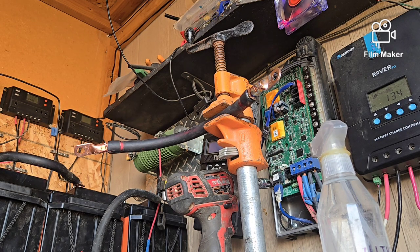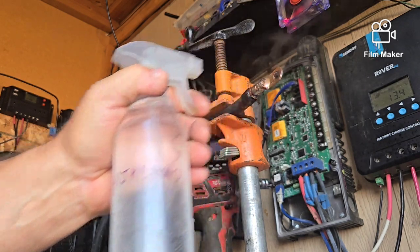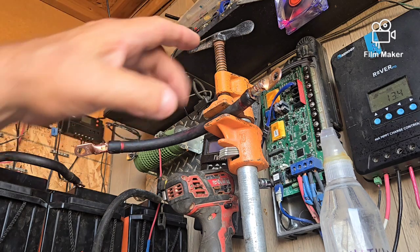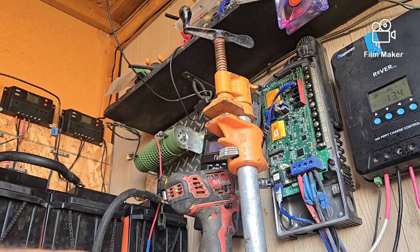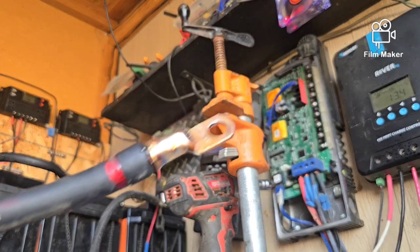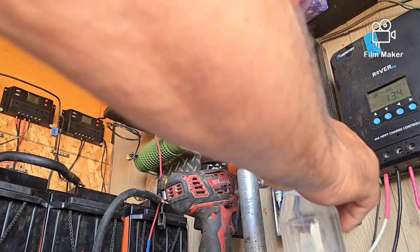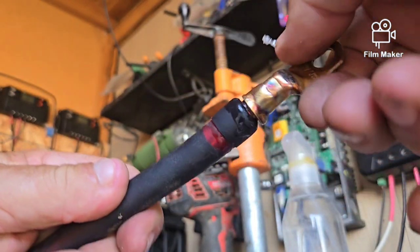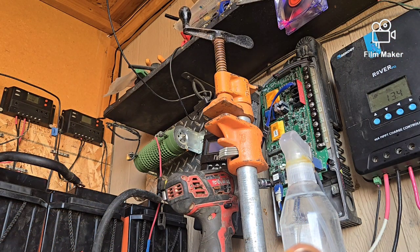I'm going to shut this off so I don't burn extra fuel, drag out my next six-inch length of solder, and have it ready for the next one. In the meantime I'm going to give this a little spritz. That's all it takes — now it won't fall off when I jiggle the wire. I'm going to take this outside and finish cooling it so I don't burn my fingers. It's just warm right now, but as you can see that is on there for good — that's not coming off. Much better than any crimp.